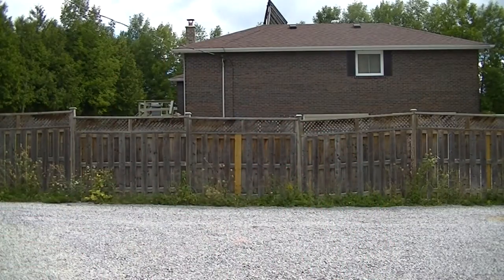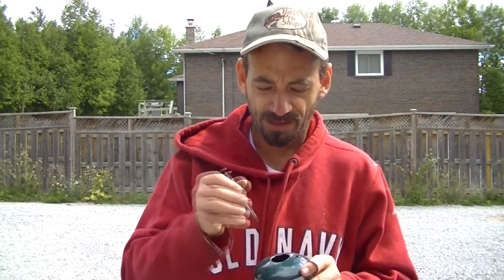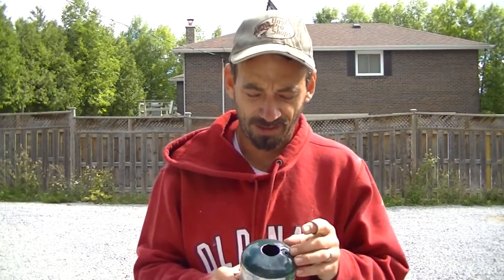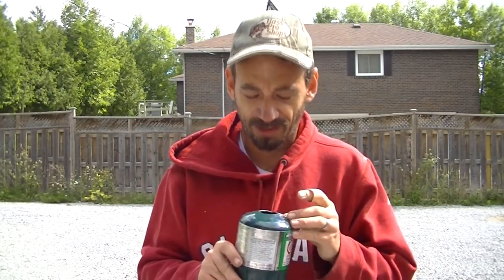Then I made that little tool from a Briggs carburetor bolt — slotted it with my grinder, right diameter, beautiful thing — and I unscrewed the relief valve, then the main tank valve, and shook out whatever remaining propane was there. Then I filled it to the top with water from a garden hose to dispel any remaining gas, and just to make myself feel even better I drilled the exhaust outlet while it was still full of water. Let's create some neat stuff, but let's not die in the process — nothing kills a good time faster than a trip to the ER. That's your public service announcement.